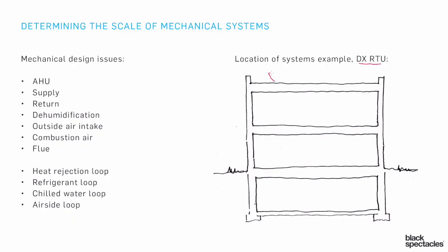This is something that sits up on the roof, and it's a perfect thing for multiple tenants. It's a package unit — a DX RTU — and you literally buy it off the shelf. They would adjust and customize it just a little bit to fit your exact needs, but essentially you're buying it off the shelf.